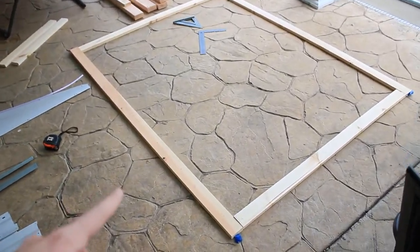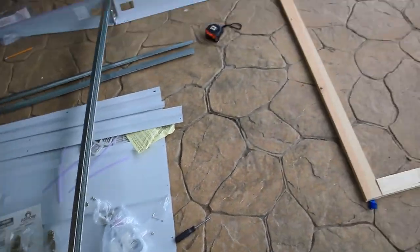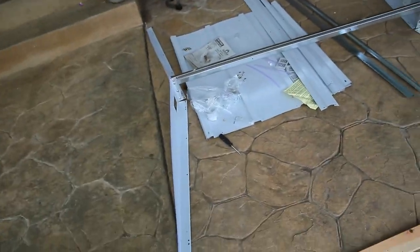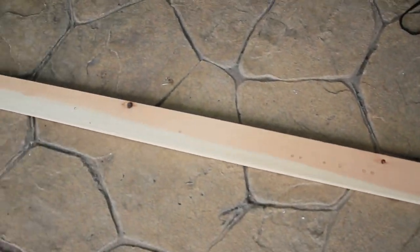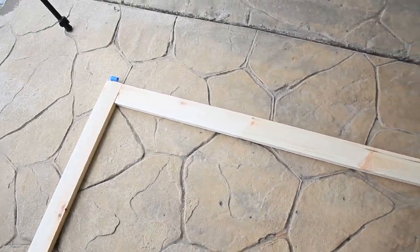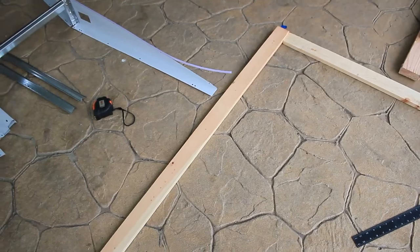So I've got the wood cut in the shape of the roof, so this is a completely square frame that the roof will attach to. You saw me set it on there with the GoPro footage, but I'll do a time lapse of all this stuff. That roof will sit on these, and I'm going to screw it down where I have those holes marked, if you can see it. And this is the 5 foot side, which was only about 52 inch long cuts. It's about 4'3" across. Yeah, this will be the frame of the roof.